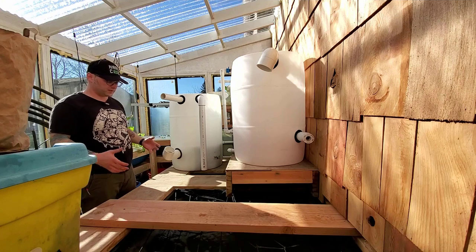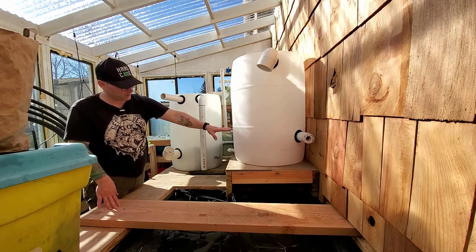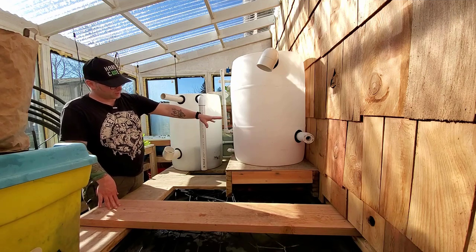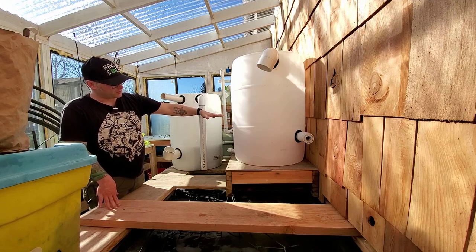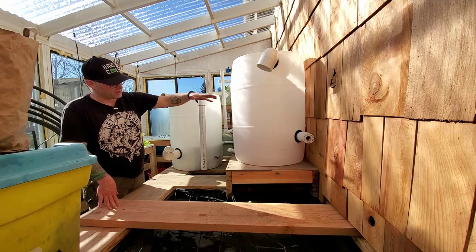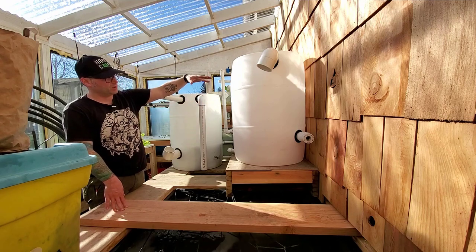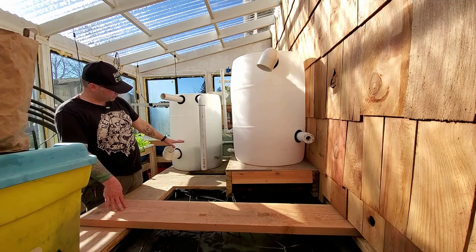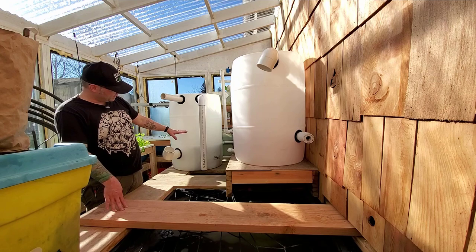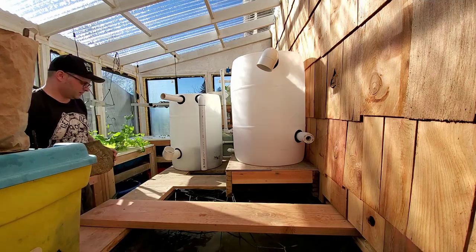First thing I'm gonna do is get some much larger stones and put them down in the lower level down here, right on top of that crate. So there's no rocks under the crate. And then the big rocks go down to prevent any of the next layer, smaller rocks, from falling down inside, and so on and so forth. And then it will come and drain down into this one, where there will still be some big rocks doing the same thing. And then I'll quickly get to the 3/4 minus, and then I'll do a 1/4 minus to fill that thing up.